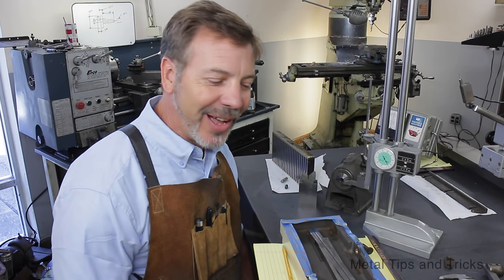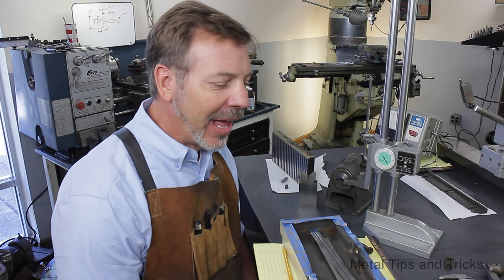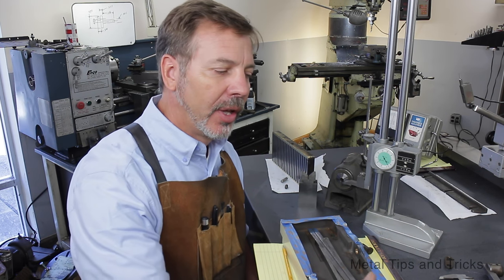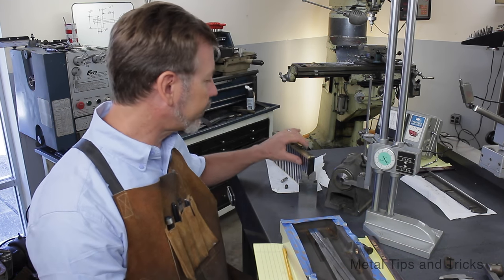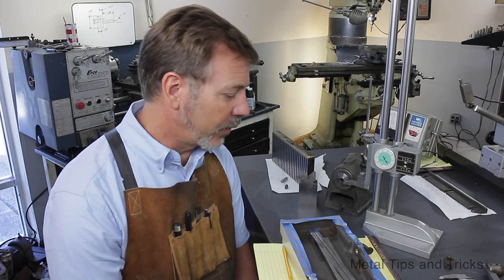The magnet and the top surface actually worked out really well. What I ended up doing is I tried to surface them with wet stones, but for some reason it just wasn't working as well as I'd like, so I went over to the surface grinder, ground them, then took them back and stoned them down a little bit. They turned out really well, though I had to take off a lot more material than I really wanted to because of the rust — and that is why we're doing this repair in the first place.